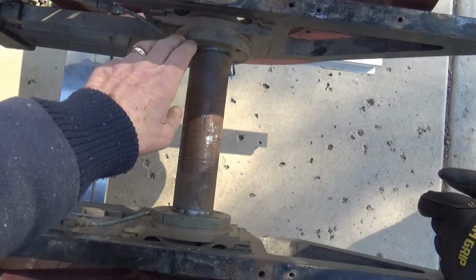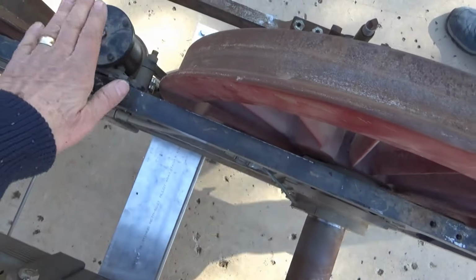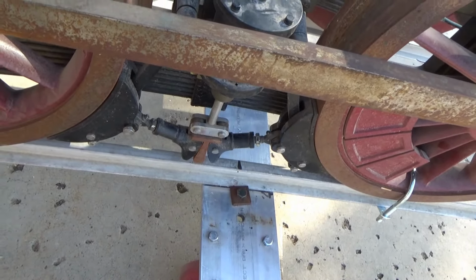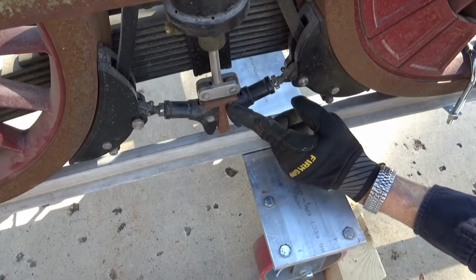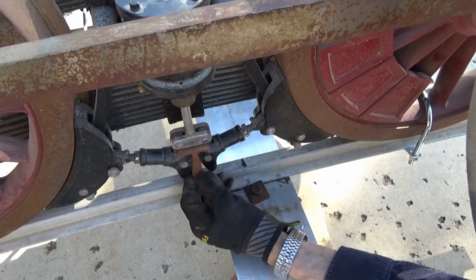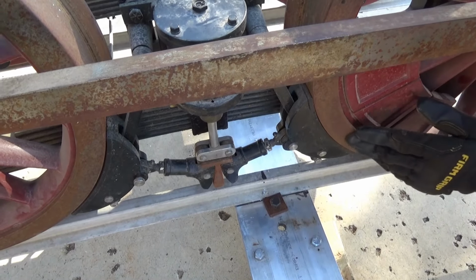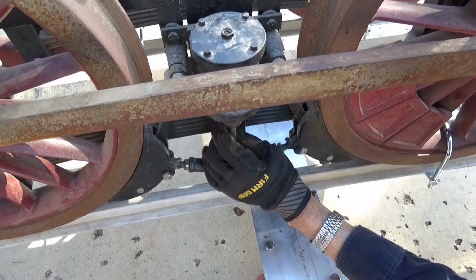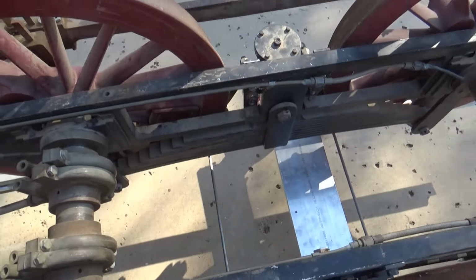All right, and here's the lubricating component for the main bearing on the axle. These look like brake cylinders here. You can see how the shoes are crunching back again. Because as that brake cylinder sucks upward, it picks up a curved arm here, and as that arm rolls on this wedge-shaped device, it pushes outward, and that applies the brake shoes to the wheel itself. So that keeps the brakes applied, and then releasing it, it drops down from gravity and the brakes release. And of course the massive leaf springs on the back.